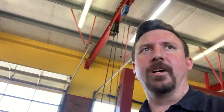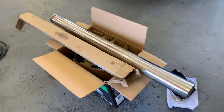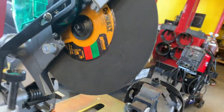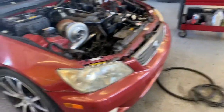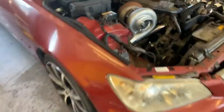I have not found a downpipe that looks like it will work with this exhaust manifold that we currently have on the car, so it's definitely going to be very custom. We've got a four-foot piece of stainless 3.5-inch pipe and a cheap miter saw from Home Depot with a DeWalt cutting wheel meant for all types of metal materials. I cut through it with a Sawzall down here just where I was practicing, and it was tough. So we'll see how that holds up; I've got a few extra blades. I'm going to start at the V-band at the back of the turbo and make a small pie cut to get started.